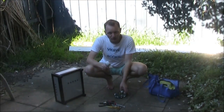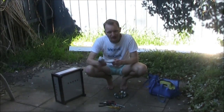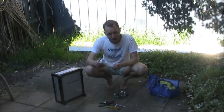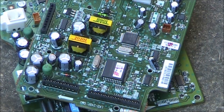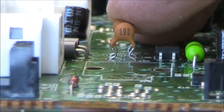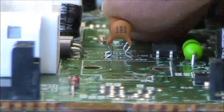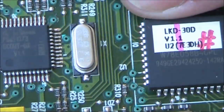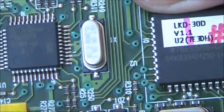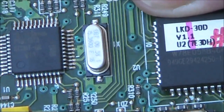I've pulled them all apart and you do get a handset, the receiver, and inside an electret microphone and various printed circuit boards. Most of the parts are surface mount but there are some through-hole components. RF chokes are also useful and there are a couple of crystals — I can see 24 megahertz and 15.36 megahertz.